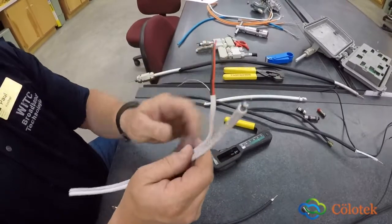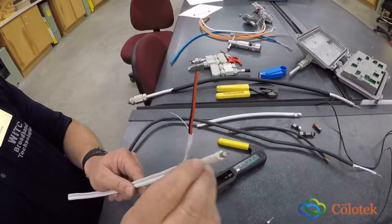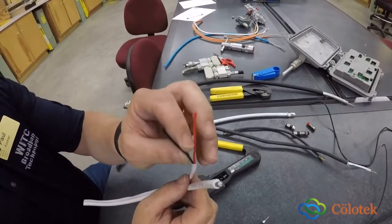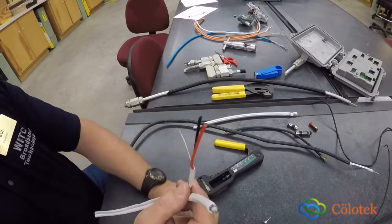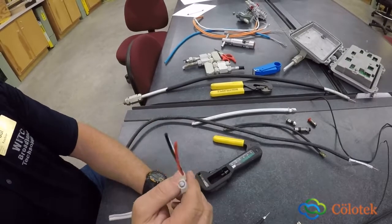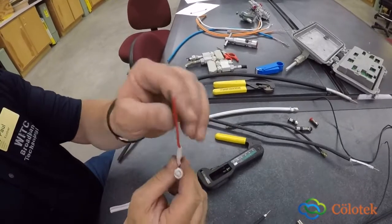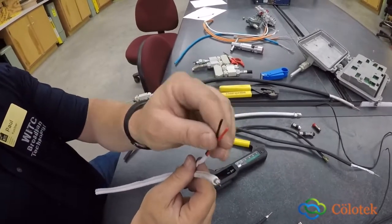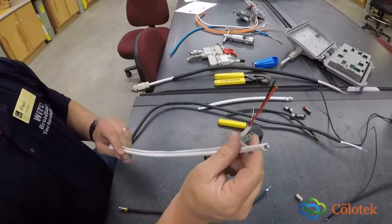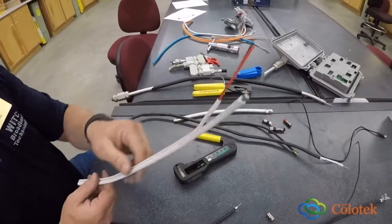Now, for this type of cable itself, I said it was for surveillance. So the video signal from the camera is run through here, but the camera needs power. So that power is connected through this red and black, okay? And usually all cameras are run off 24 or 12 volt DC power supplies. Most often 12 volt. And that's what these are, okay? This is going to power up the camera. It's going to go back to a power supply, be terminated. And once again, everything else is uniform. And you can get this in black or white and maybe other colors as well.